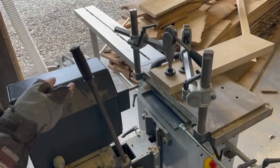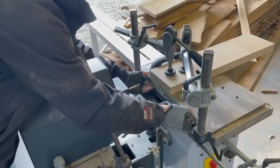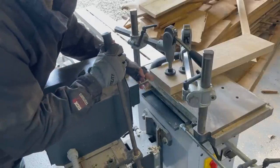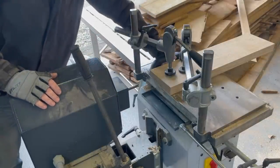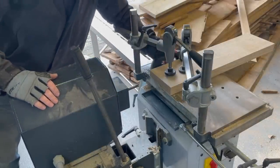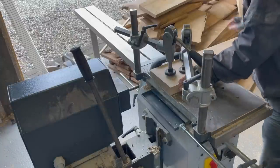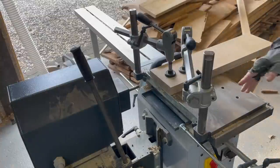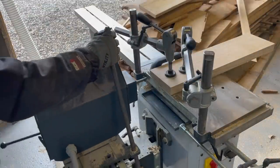If you're doing any end cutting — and this is actually going to be the rails for our doors — you can raise this little stop, which is really handy, and lock that in. Check that it isn't going to collide, then move your end piece. There's this little brace here to give you a perfect mitre. I've gone onto two clamps because you put in quite a lot of forward pressure, even though we're not cutting with a mortise bit.